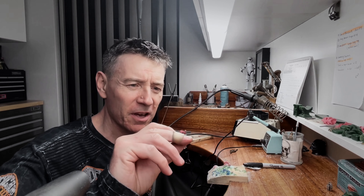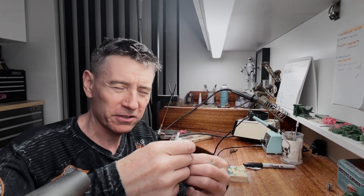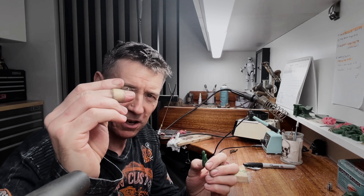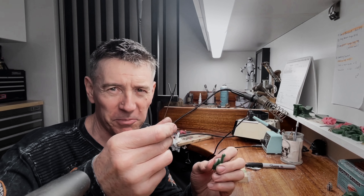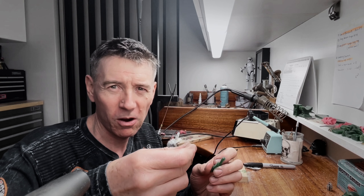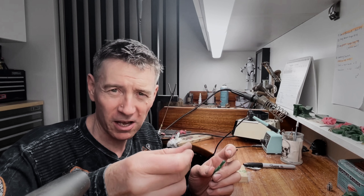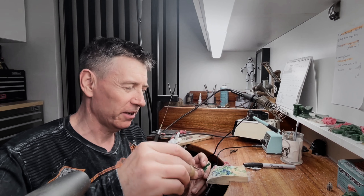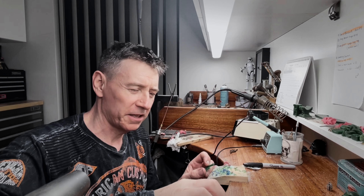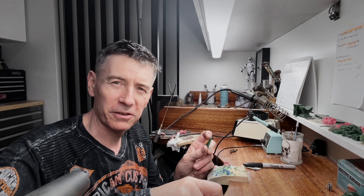We're about 90% done on this. I want to drill a hole through here and that will run the jump ring through. I'm just going to do this by hand. Obviously I can use my micro motor but I want to do this by hand because not everyone can afford to purchase a micro motor. If you're wanting to follow some of these steps and you've just got a little simple setup at home — maybe a couple of files and a little saw — this is going to make it easy if I just show you how I do it by hand. We're going to use a little drill and then another little drill to open the hole up a bit more, and then you'll be able to run a little jump ring through this once it's cast.